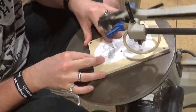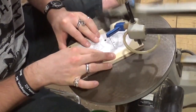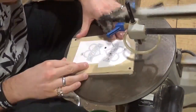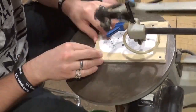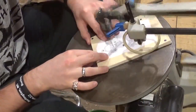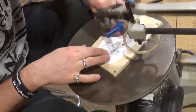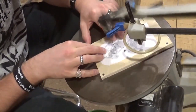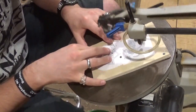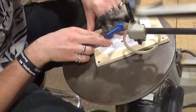I am using number 5 reverse tooth shark tooth scroll saw blades on this project. The project is designed by Steve Good and is available as a free download at his website at scrollsawworkshop.blogspot.com. Please do not feel intimidated by the small interior cuts on the word 'mother' — just take your time. If you have a variable speed scroll saw, you can slow it down or speed it up however you like. I leave my scroll saw at basically one standard speed unless I'm cutting something really intricate.